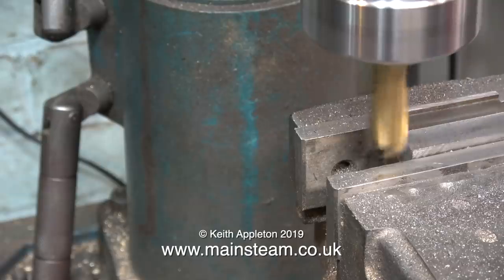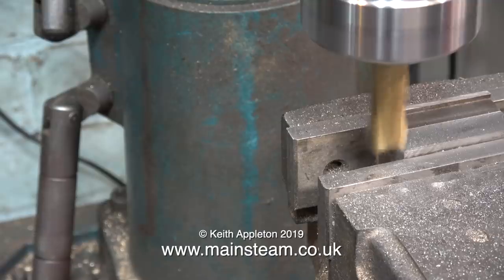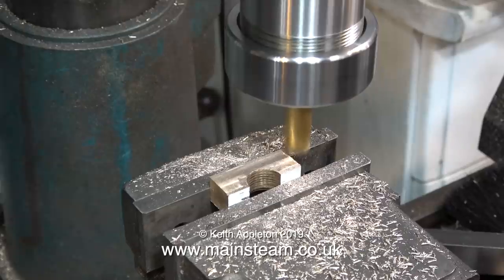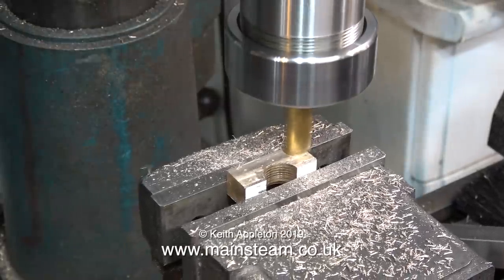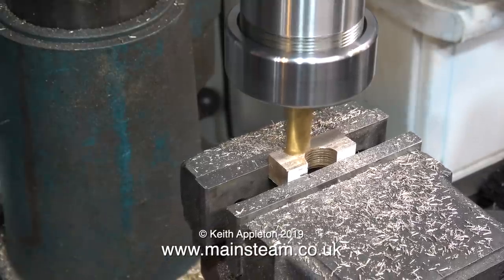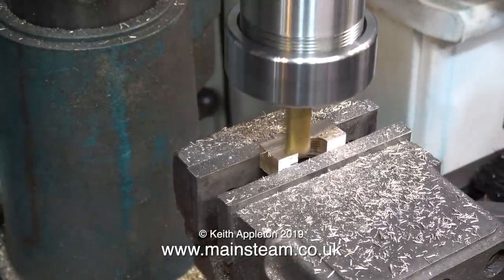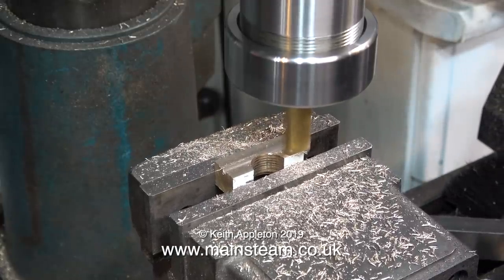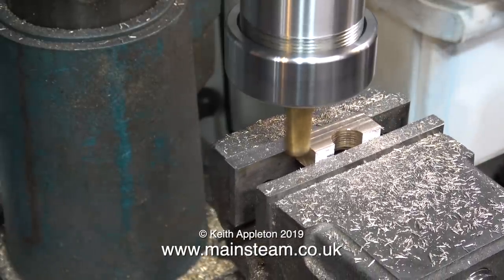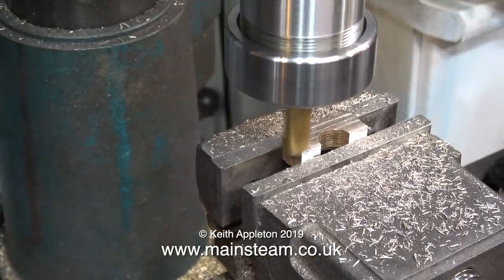So I tighten the collet chuck ring as much as I dare, and I'm now milling in the opposite direction. This is a piece of cast iron and I am going slightly too fast — I admit that — but I want to test the durability of the cutters. In this clip, I've mounted a piece of brass in the machine vise and changed the cutter for an end mill. An end mill has four cutting surfaces; a slot drill has only two. I'm now milling one side of a scrap piece of gunmetal — one side of a main bearing that I made a mess of. I always keep parts like this, just to remind me that I am, after all, a musician, not an engineer.